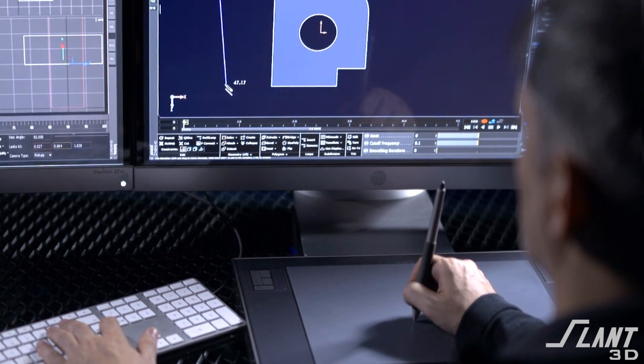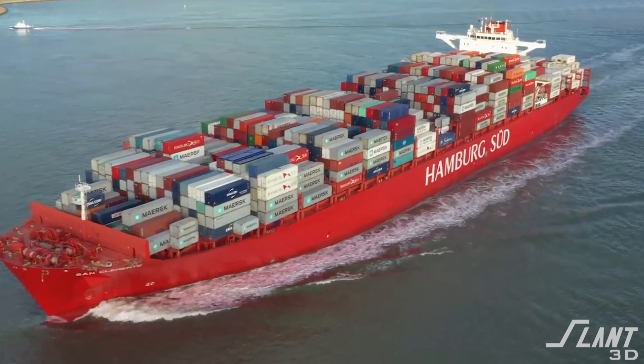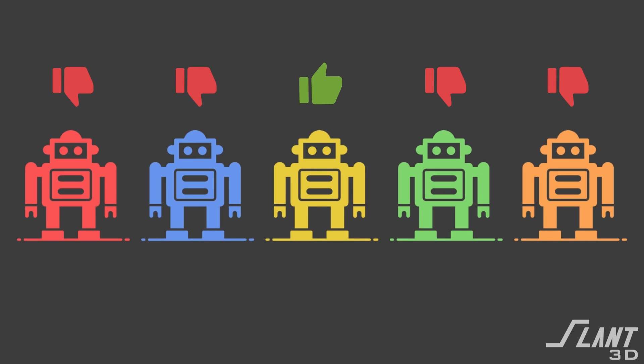That's fine if you're making millions of them, but if you want to try a new design or start manufacturing a new product, that upfront expense is very high risk. 3D printing has the huge advantage of not having any significant startup costs — no molds, less shipping — and you're able to try new things and iterate over time. But generally, people consider 3D printed products inferior for food applications, saying FDM is not waterproof and not food safe because it's difficult to clean due to layer lines.